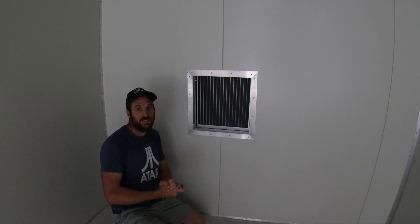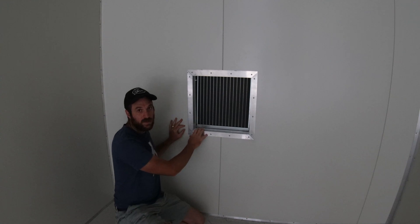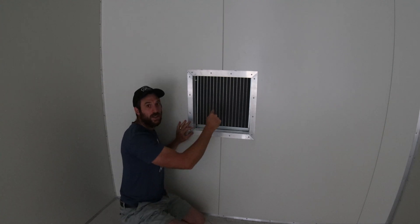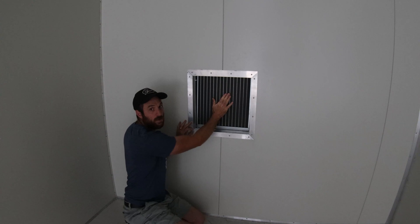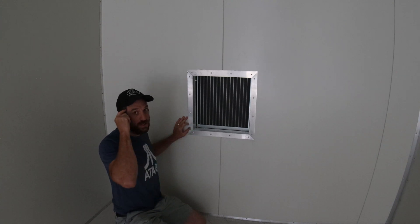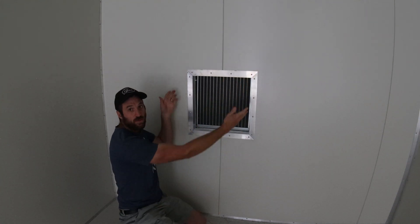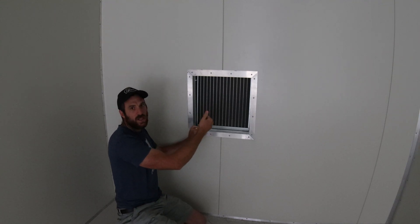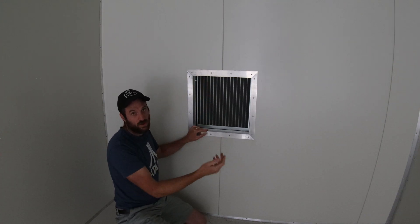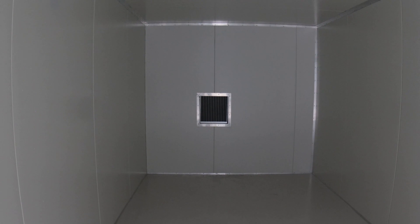Apologies for the echo in here and the poor lighting — there's no lights mounted in here and it's really echoey. But you can see here, this is where the heat exchanger is mounted, and this just has a nice piece of aluminium extrude around it, and the air will float out of here straight through that heat exchanger — heat recovery device right there. If I want to filter the air, my idea is to get a filter mesh or filter cloth, and simply have it magnetised to the wall around it. You just throw it on and it will take those spores out of the air before they move through the exchanger and the fan. However long it takes for the filter cloth to get a bit blocked up, you simply take it off, throw it in the wash, and put a new one on.